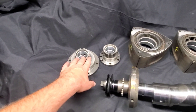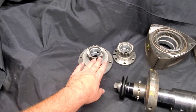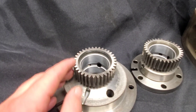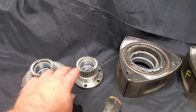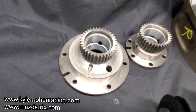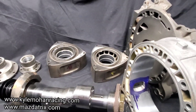While I've been racing and working, I did manage to get the rotor side cut done. The stationary gears we face-cut to remove any stress risers, so you can see they've actually been slightly polished — they don't have any of the factory gear marks. That way we reduce the chance of any type of gear cracking, and we went with new bearings and gave these a quick polish.